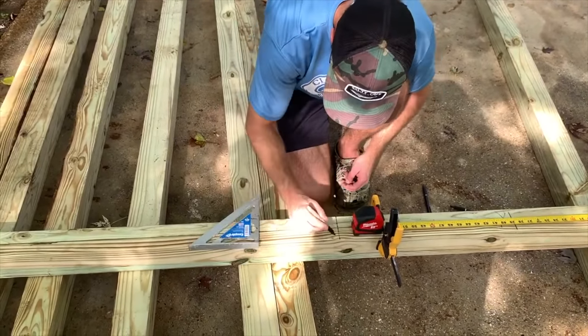Now for the first shingle in the third row, we're going to trim 11 inches off this time. And again, this is just to stagger the joints in between the shingles. So taking our first shingle for the third row, which has 11 inches trimmed off, we started and maintained the 1/4 inch overhang, and we installed the shingles the same way all the way across.